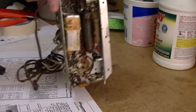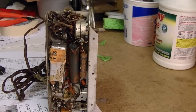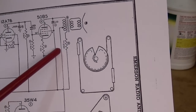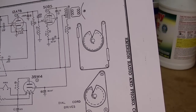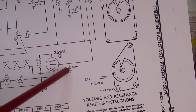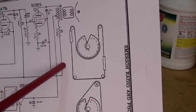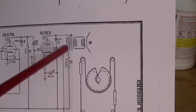I've been poking around under the chassis a little bit. The first thing that caught my attention was this resistor that's fried and charred, and this capacitor that's blown an end out. I studied the schematic and traced out the wiring and found that the completely fried resistor is a 1K resistor — the parts list calls it a filter resistor and it should be 1 watt. Here's the rectifier tube, so here's our positive voltage supply. One filter cap here, we go up and around through the output transformer, down through that 1K, and there is the other filter cap. I would not be surprised at all if this cap shorted out and took out that resistor.